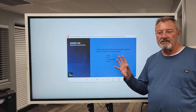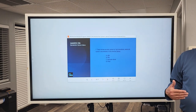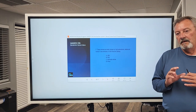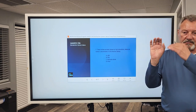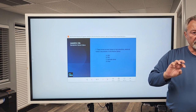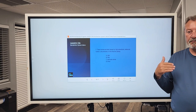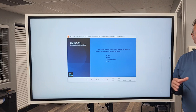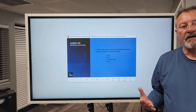So a combination air release valve will allow air in. It's got an orifice, and the design is, if air is in the pipe, it allows the air out and keeps the water in. As soon as the water drains away, the element opens up, and if a vacuum is behind it, there's less pressure in the valve body, it'll suck air into the line, or let's say not allowing a vacuum to build.